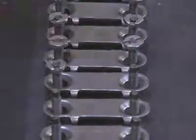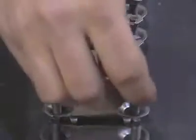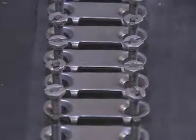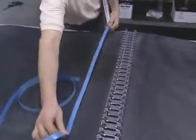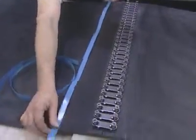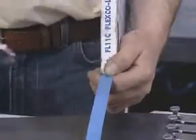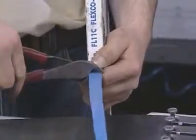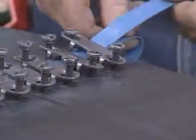Note that the bolt solid plate fastener system makes use of FlexCo's exclusive piloted bolt assembly for faster installation time. Prior to tightening the nuts on the bolts and before the plate teeth are driven into the belt surface, trim a length of FlexCo lock tape to approximately three and a half times the belt width. Next, feed the tape under the top plates, between the bottom plates and the belt surface, and then back under the top plates.